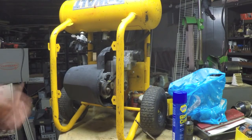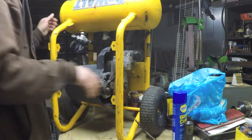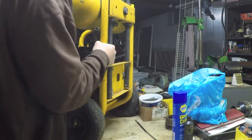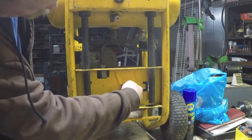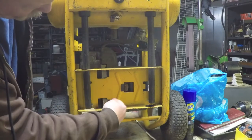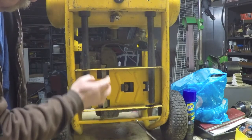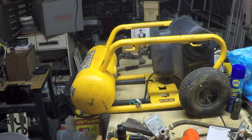So I think the first thing I'm going to do is take this old compressor from this DeWalt off of here. Get it out of my way. Well, I'll probably throw a cord on it and fire it up just to see if it runs, just out of curiosity. So it's kind of interesting where they get this mounted. It looks like there's one bolt here you loosen, which undoes this clamp, and then I think that allows this compressor to move this way far enough to unhook from these metal tangs that stick out over here, and so the whole thing just comes off by loosening one bolt.